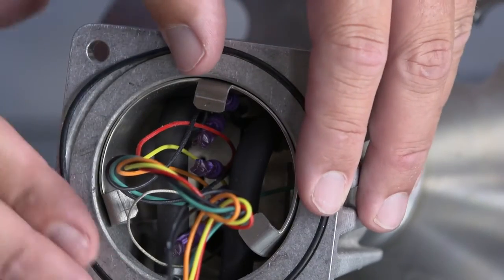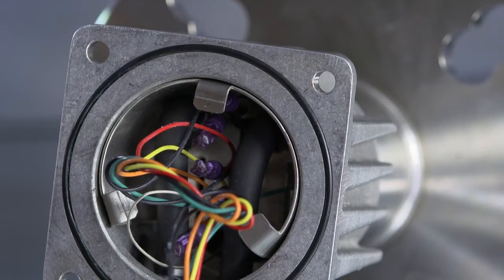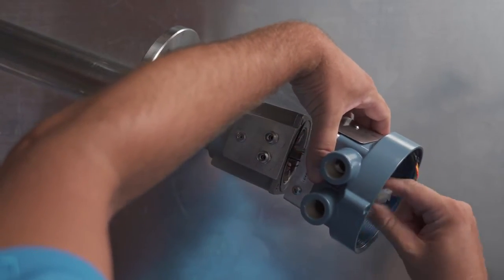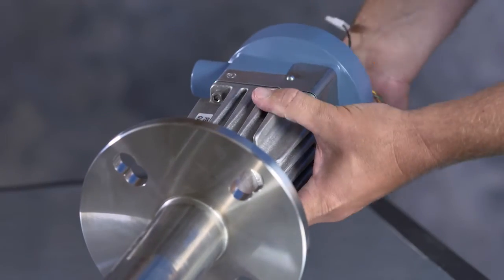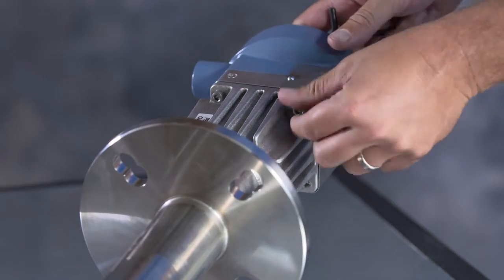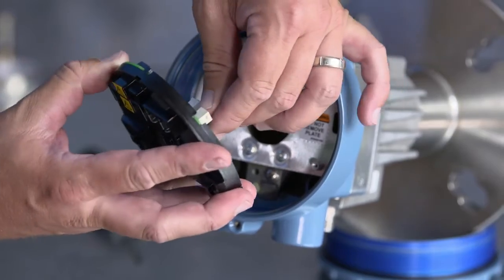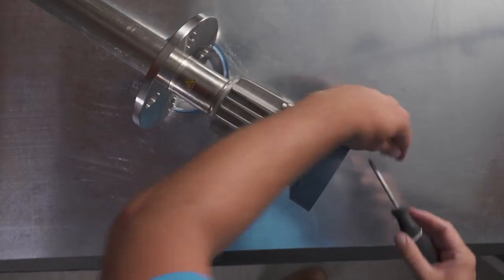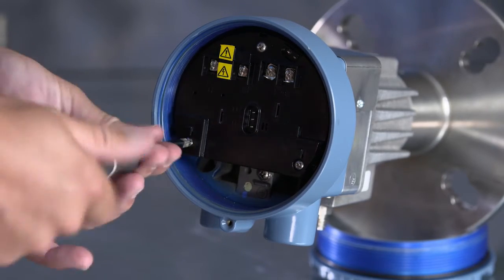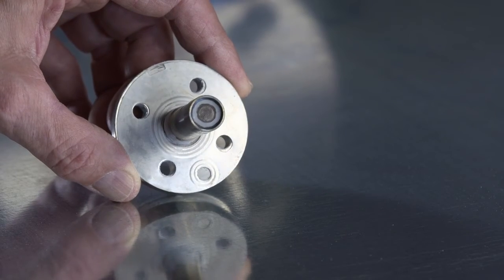Verify that the housing cover O-ring is not damaged. You can replace it with one from the kit if necessary. Feed the wires back through the blue housing. Align the housing to the heat sink and torque the four housing bolts down at 35 inch pounds. Connect the quick connects to the electrical boards. Screw the board and cover back into place — there are spare fasteners in the kit if you lose yours. Now that you've replaced the cell pad and wire, you are ready to continue the process of replacing your sensor cell.